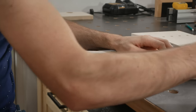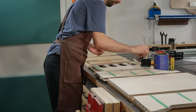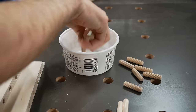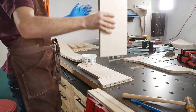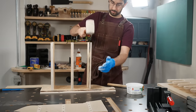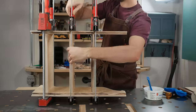I like to pre-finish my parts before gluing up. I broke all the edges with my router and a roundover bit, gave all the parts a quick sand, then finished them with General Finishes High Performance. A water-based finish is better for lighter color wood so it doesn't yellow. I had taped off areas where joints meet, and now it's glue-up time. I threw a bunch of dowels in a tub and poured glue all over them to make a glue dowel salad - each dowel gets a good coating and I pluck them out one at a time. I glued three shelves onto one side first, then glued the other side onto the opposite end of those three shelves.